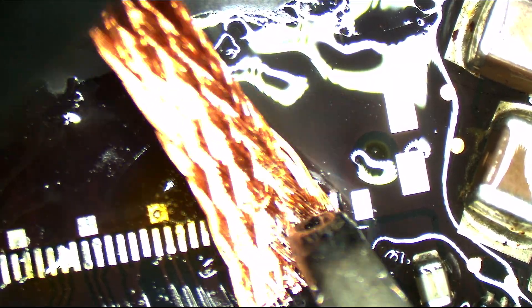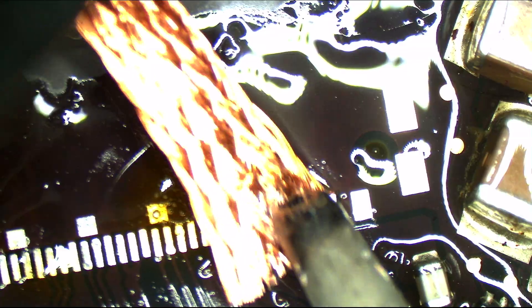So we're going to scrape away on pins three and four, scraping until those two pads that once looked like they were gone — that were burned, that looked like they were desecrated off our board — are now brought back to their original luster. Take a look at pins three and four for the backlight. Are those not beautiful pads? I think those are beautiful pads.